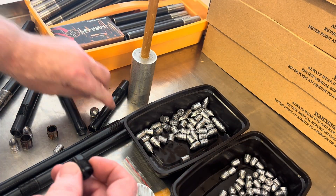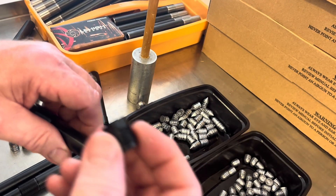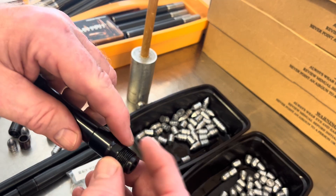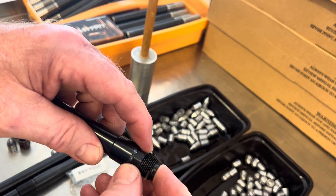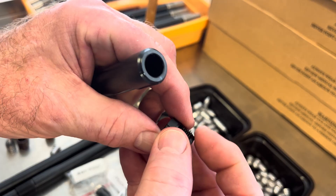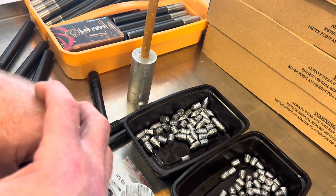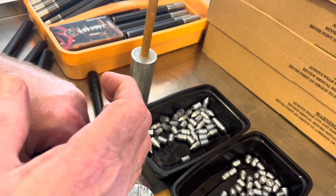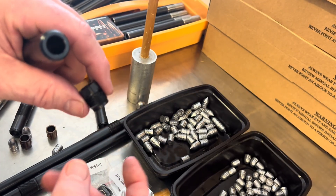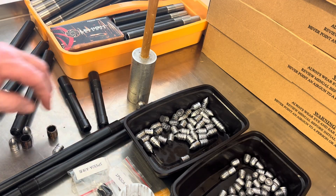This is a real good idea because if you're just using this piece of plastic as a chamber and the barrel has not been chambered — has rifling right up to the end — this plastic is not a chamber. If you've seen videos where these things are shattered and lying in little pieces, that's what happens when 4,500 to 5,000 PSI doesn't have anywhere to go because the pellet's gotten sideways and locked in, and that little piece of plastic just explodes. All of that is inside the barrel holder with the air plenum up against it, so it shouldn't be a danger to you, but you'll burn right through these over and over again.